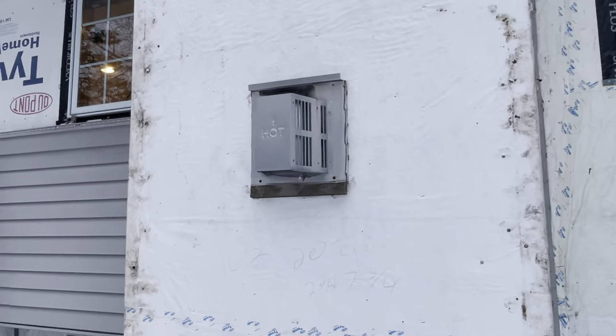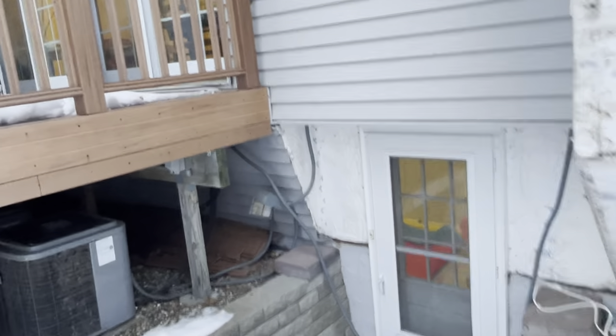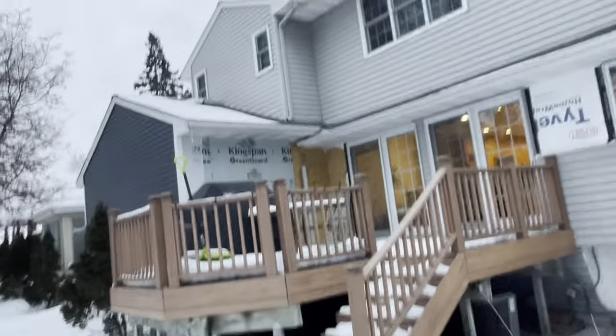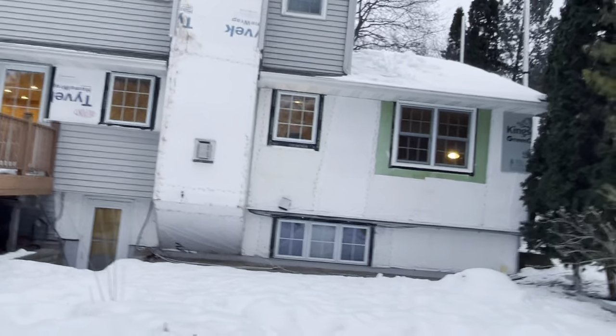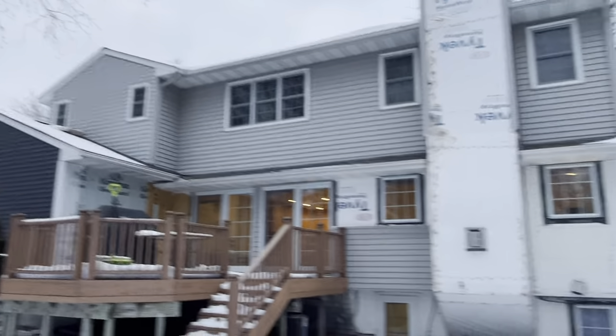This is especially important if we're working with the insurance company - we need photos because it's something we need to charge and bill for. Here you've got a gas fireplace vent - those do not get replaced when we're doing siding; they always remain. You've got power meters and what looks like an electrical box for the AC unit - those get detached and reset. Exterior lights and electrical outlets also get detached and reset. Once the job is done we'll have an electrician come out to reinstall everything. Some cities require permits for that - the electrician handles it, and that's also the opportunity for the homeowner to install new lights.